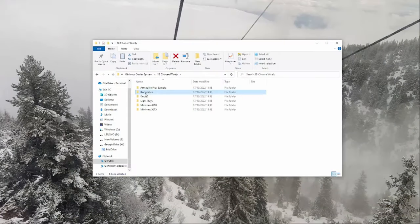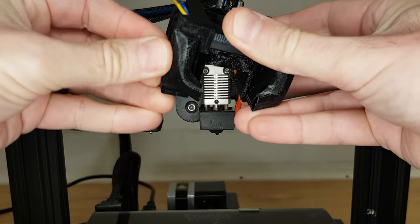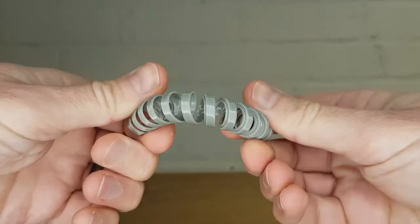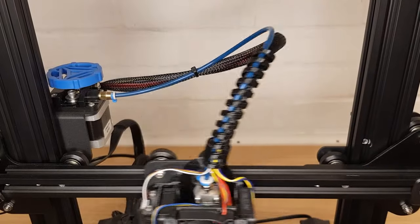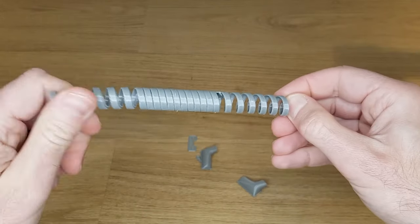Likewise choose a backplate to suit. If you want to also give support to wiring then choose a file labeled for wire management, and then select a file depending on whether you have a bed probe or not. I have a CR Touch, standard fans, and want to support my wiring, so I'm choosing a file labeled backplate_bl_cr_4010_wm for wire management. The ducts slot in the bottom and are similarly labeled. Paul has added some built-in supports for some of the files which are used and it makes things easier. If you've chosen to use wiring support then also print the armadillo flex sample. This is a genius design which gives you excellent cable support. It's easy to print with the included supports and it's flexible to move with your printer components. The file is 100 millimeters long but it actually prints two pieces together so you end up with 200 millimeters of flexible cable support.